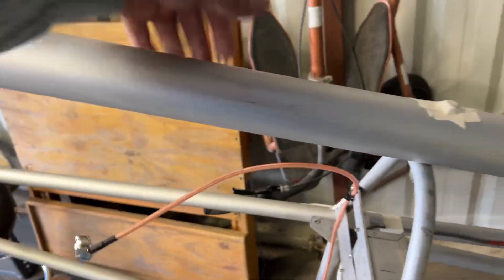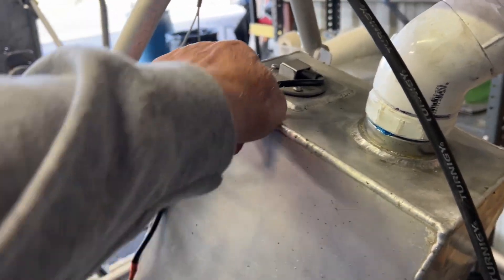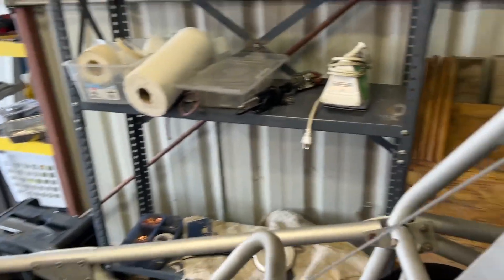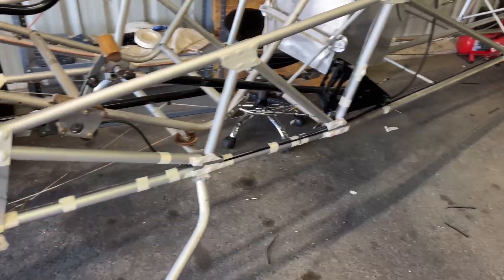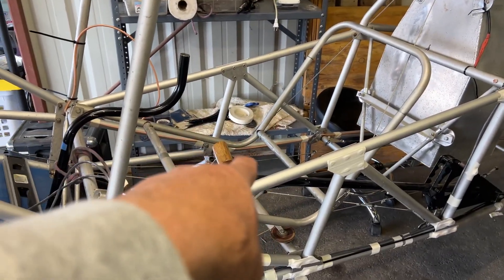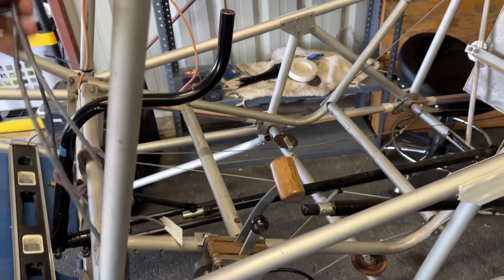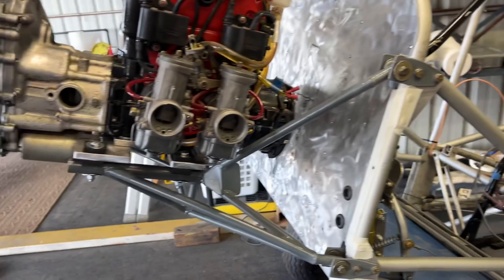This is the antenna cable here. I've got the signal and power wire run for the fuel tank level sensor, and I brought everything up as you can see. The wires are right along the stringers — you can see the antenna cable over there. I brought everything up right along the post and this will come right in nicely behind the instrument panel.